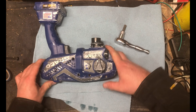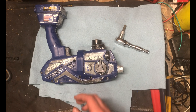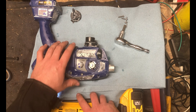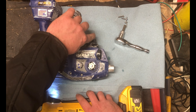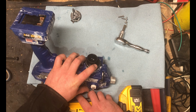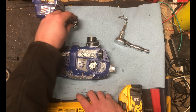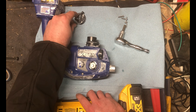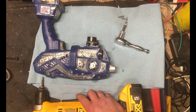Nice and clean. Plenty of screws. This is the selector valve, which allows you to return and prime the pump - it sends paint out of this hole, so it comes in this hole and then back out of this hole. Once you bleed the pump out, you switch it and the paint goes out the nozzle. That's all that does.